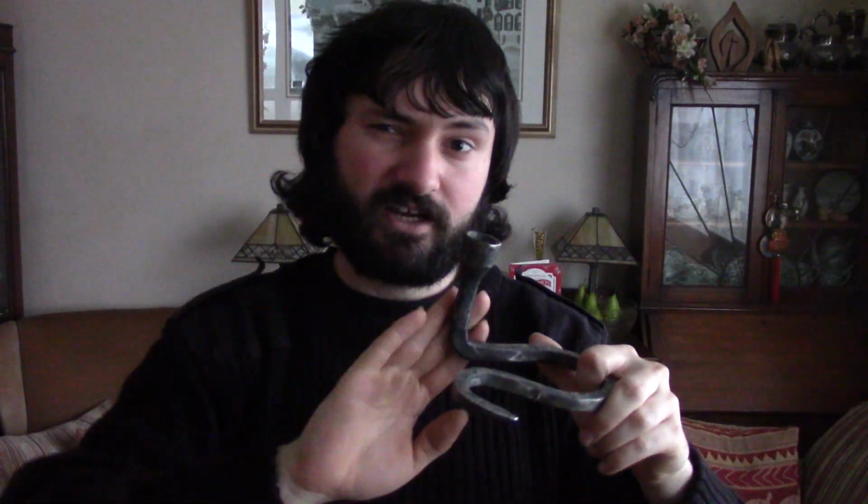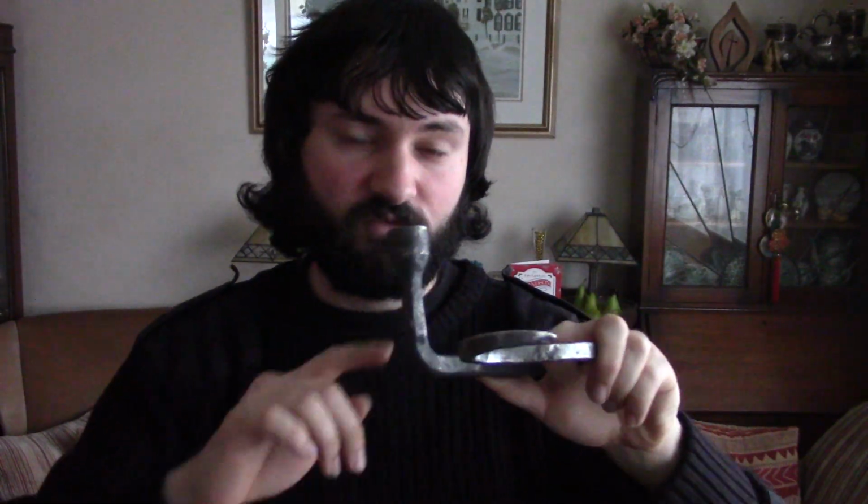And the reason is because I think this is actually made of some sort of tool steel. I should have realised, because there would be a lot of strain when you're putting the torque onto a car's bolts and things. But I hadn't, I just assumed it was a mild steel, and I quenched it, which is why it's got the cracks. So it was harder to work while I was forging it, and I thought it was because it was thicker material, but it's actually got more carbon content. But apart from that, like I say, when I quenched it, that's why those cracks formed up.